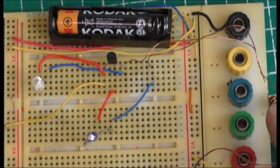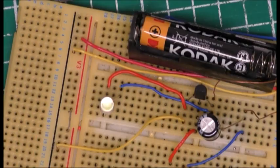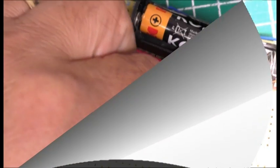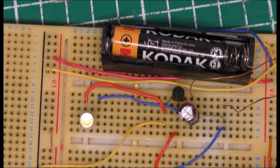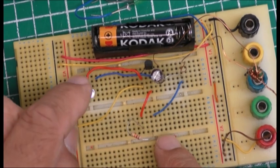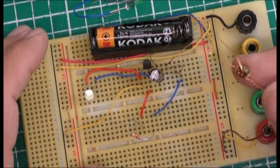This is working now — as you can see it's lighting up. I've put a white LED in so it's lighting up. I've got a resistor and capacitor connected there, and the white LED is flashing. The only way you can really see it flashing is if I turn the main light off — as you can see it's flashing, that's what it does. Now with a different capacitor, turn the light off — it's flashing the same way. I took the resistors out and put only one in — flashing the same.